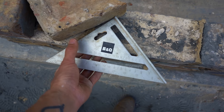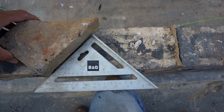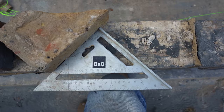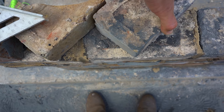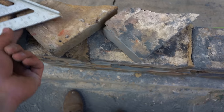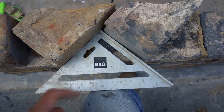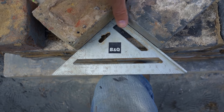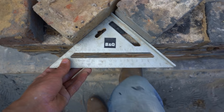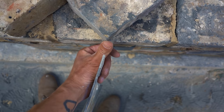To get these angles right I like to use a roofing square. As you can see here there's a gap here and not at the top. What you do is use that square to get the first brick in place, make sure that it's squared to the front, then get another brick, line it up with the front and also have that 10mm gap. Imagine that these go out the back — these are full bricks — and again make sure that is 45 degrees with your roofing square. I've got this one from B&Q — not promotion — but as always I'll leave links for the tools down in the description. That will give you that 10mm gap and also has your arris in line with the brick below.